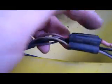I've pulled all the wires out of this connector, tugged on them, and none are falling apart. With the key on, if I touch the battery cable, the generator light isn't doing anything. The problem isn't here — wiggling everything hasn't changed the fact that the generator light isn't on. So now I'll have a look at the fuse holder.